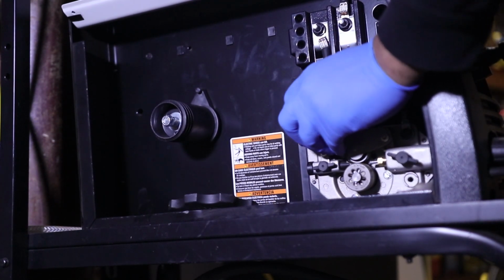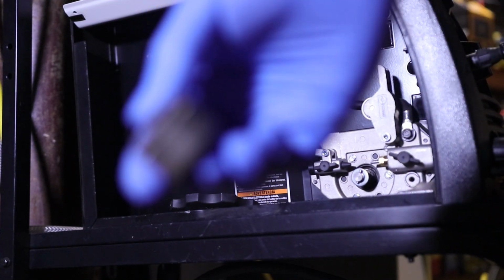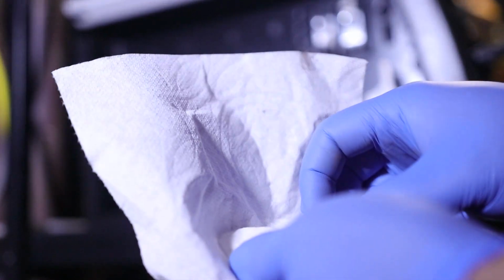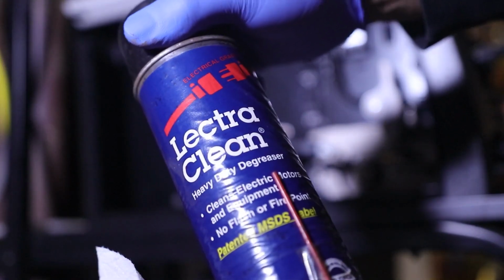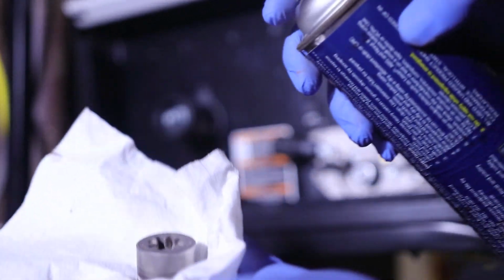But before we do that, let's go ahead and take a roller out. There we go. And you can see we've got a little bit of boogerage on there. Okay, so in respect to our fellow YouTuber Fix-It guys, I got a little piece of paper towel here, just Costco paper towel, nothing particularly special. I got our roller right here for the wire and some kind of cleaner. I just found out at the filming of this that I ran completely out of brake clean, which is what I usually use because I just try to find something that doesn't have really any oily residue afterwards. You don't want this getting caked up with oil and causing all kinds of problems later.